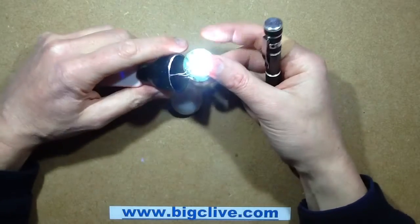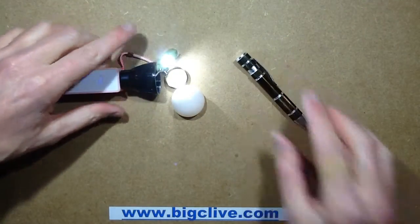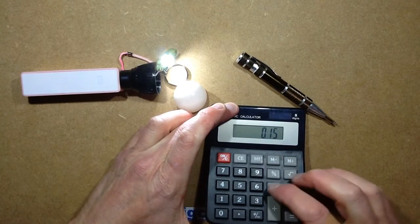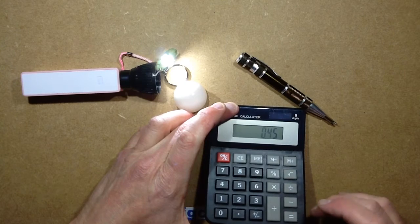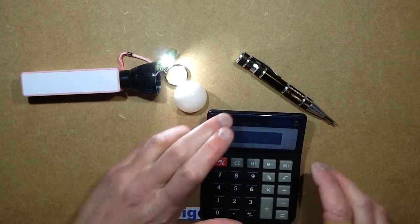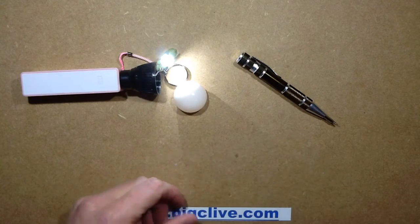So that's fundamentally it — the LED is being run at about 150mA. Let's see what the power rating is: 0.15 times 3 volts dissipation equals 450mW, so that's pretty typical for a half watt LED.